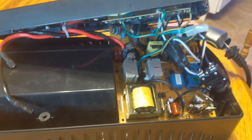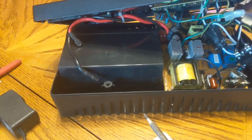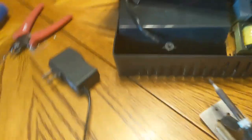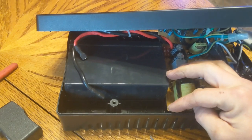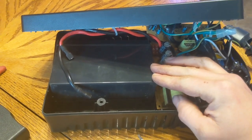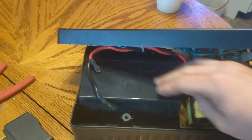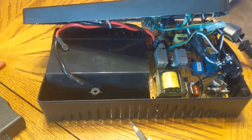There's one more thing I did: I removed the speaker. It was somewhere on the main board. I just took the main board out, unsoldered the two contacts on the back, and removed the speaker, so it doesn't beep whenever the power goes out — that's irritating if you're watching TV. We also upgraded the battery. This unit was picked up on eBay cheap without a battery. It originally came with a battery about half this size, with foam pads making up the difference. I happened to have one of the larger size batteries and this case was designed to house either size, so we just put the bigger one in. For the other two units, I ran the two power cords out the side, removed the internal battery entirely, and connected those cords to extensions running out to deep cycle lead-acid batteries.